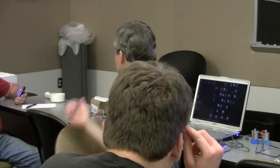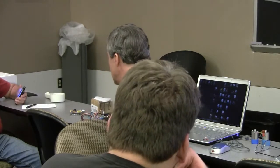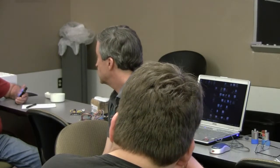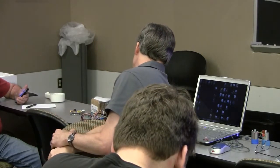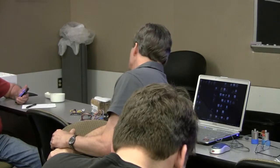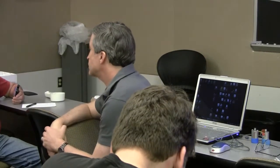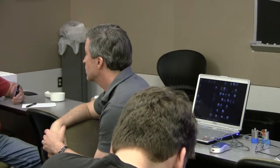Was that logic analyzer or actual oscilloscope? It's both. Oh, okay. So it's a 2-channel scope and 12 digital, although I only have 8 signals level converted at the moment. So just the digital are 3 volt, or they all? Correct. The analog is 0 to 20 or 30 or something. I think this one's the same, where I think that the analog can do up to 70 volts. No, it can do mains power. It so depends on your probe. Right. Yeah, they have a multiplier, and I think this can do like 400 or something crazy if you have the right probe.